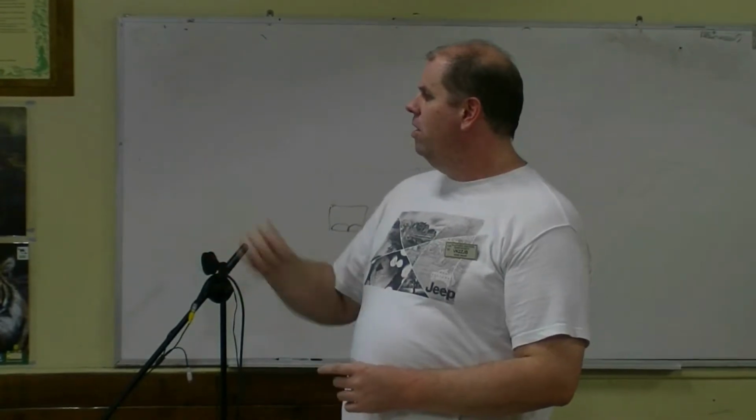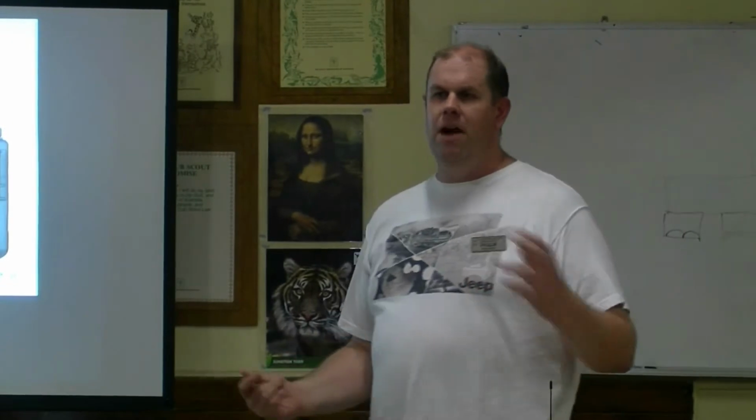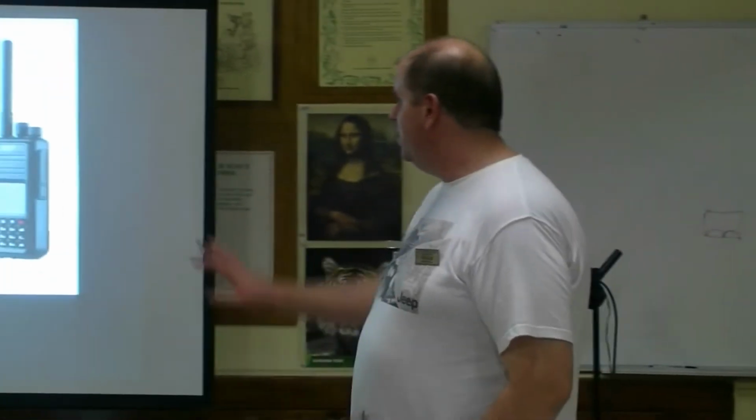Those of you that have gone looking, the Baofeng radios, that one's an FM one, but there are very similar ones out there. I think it's a GT5D, I think it was from memory, or something along those lines, a UV5D. They advertise that they're a DMR radio. They are what they call a Tier 1 DMR radio. All of this equipment, so our Brandmeister equipment, the MARC network, every bit of amateur DMR equipment is actually Tier 2. So you have to use a Tier 2 radio. So if you go and buy a cheap $50 Baofeng radio, you'll find you actually have to pay Baofeng for a code to unlock the Tier 2 functionality, which brings you back into the cost range of the TYT radios anyway. So just buyer beware.